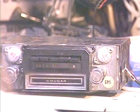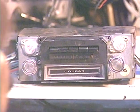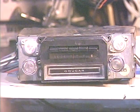And as I've mentioned in several other videos, there is a 20-second delay before that radio comes back on by itself, and that's just due to a Vox circuit that holds onto the aux signal a little longer than it needs to, so it's not constantly switching back and forth between the radio and the aux input. Radio should be coming back right about now.